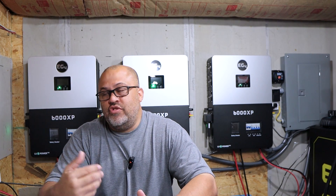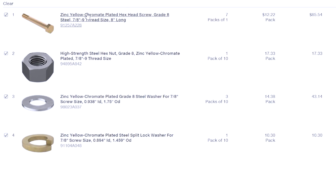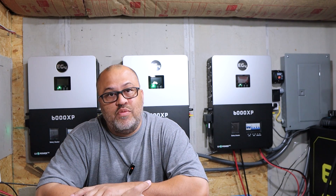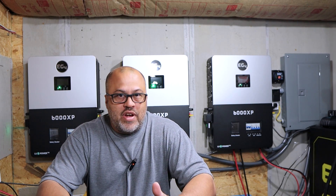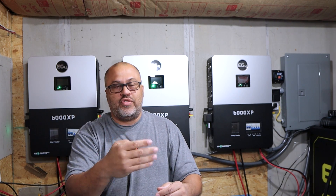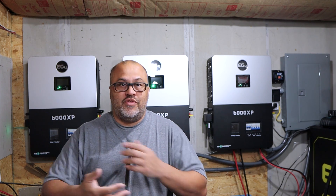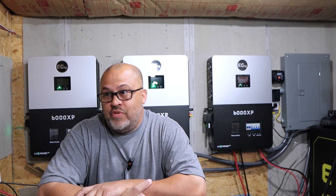Let's talk about all the parts and the price. The bolts I used are grade eight bolts. Some people think I didn't need to use them, but I went with the strongest thing I could find. With all the bolts, washers, and that whole setup from McMaster Carr, it was $91.02. That's a seven-eighths inch bolt, eight inches long, with four flat washers — a washer between every two-by-six and the post, a lock washer, and a nut. For three posts, that was $91.02 from McMaster Carr — very expensive just for that bolt, but those bolts are the only three connections holding the whole thing up.